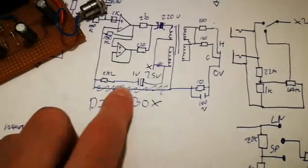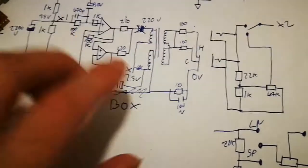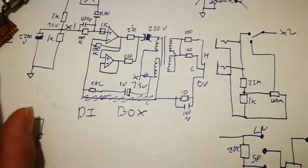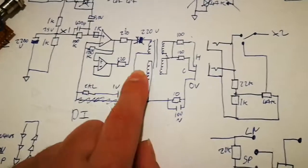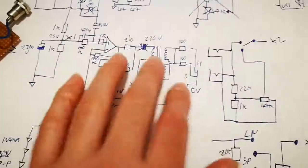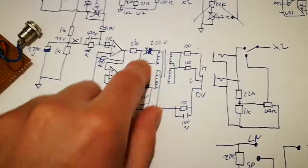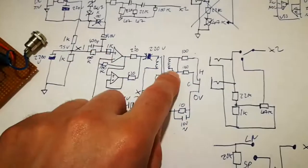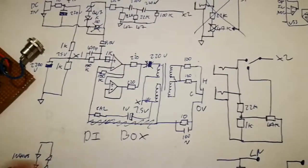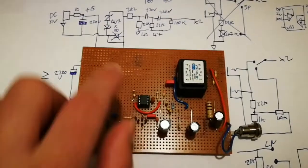The original design had everything coming back to the 7.5 volt floating supply, but that can cause issues with capacitive coupling and inject noise. Now, because it's capacitor coupled on its own capacitor, it's referenced to the zero volt rail. There are also some resistors to help isolate the transformer output from the line - they need to be low impedance so the signal can't pick up large amounts of noise on long cable runs. It helps prevent resonance or high capacitance being fed back via coupling between the windings to the op amps, causing oscillation and ringing.